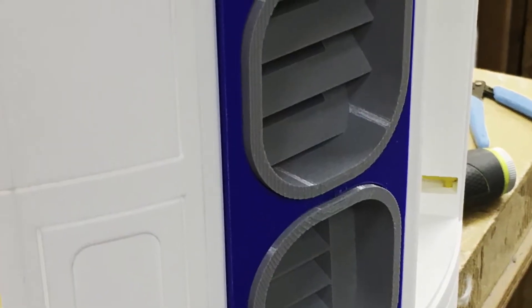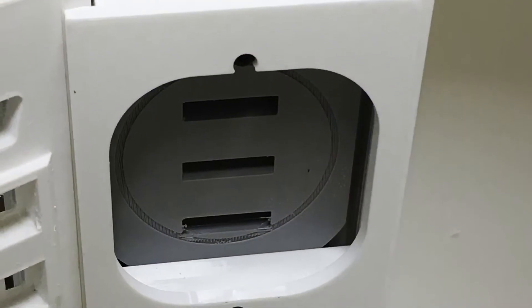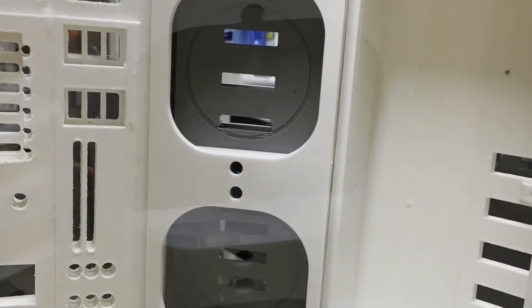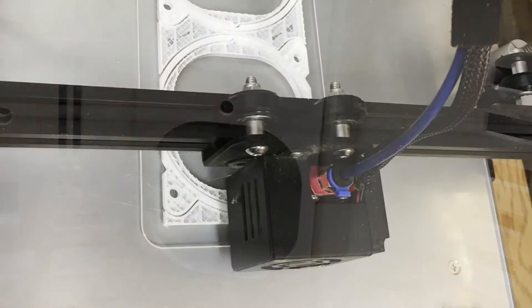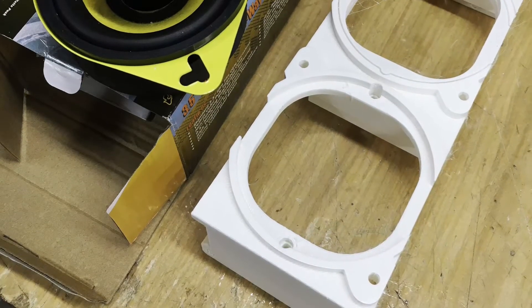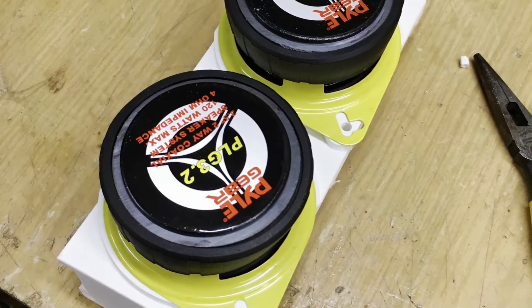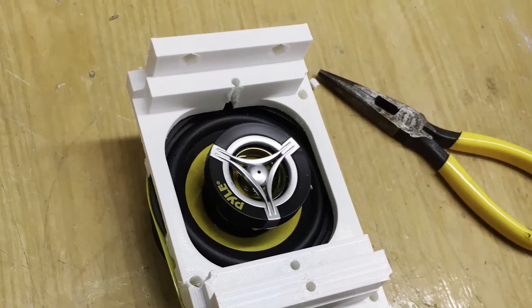Here are some of the other prints I did on the body. There wasn't a good way of mounting the speakers behind the vents — some guys do, some don't. Some guys mount speakers off to the right and left of the body and use larger speakers. I used three-and-a-half-inch speakers and custom made a mount for them. You have to install the mount and speakers in a certain sequence to get everything to match up.